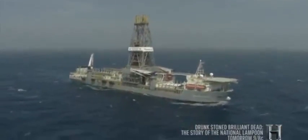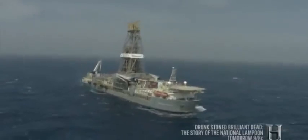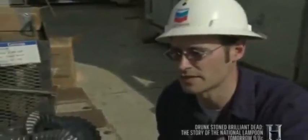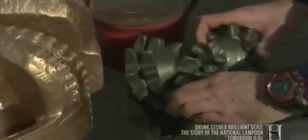From the 135-foot-long drill string assemblies to the 226-foot-tall derrick, everything on this drill rig is bigger and better, including the drill bits themselves. We've got two different types of bits here. This is a tri-cone bit, sometimes called a roller cone bit. This bit, as you can see, each of these cones individually moves. But the way this bit will drill is you'll run it on the bottom of the drill string. As it sits down on the formation and you start rotating the drill pipe, these tend to move around as it rolls around, and it rolls around and actually breaks up the formation.